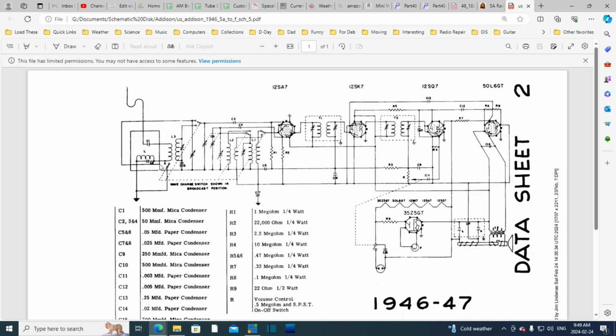So remember I showed you the antenna. There were 2 sections. One was obviously a large amount, looks like a racetrack of wire. And then inside was a circle, a small number of turns. And that would be this piece here. And this is the piece that's actually driving into the radio. This piece here, if you had a long wire antenna hooked up through a capacitor for safety purposes, through an antenna transformer, transform the energy onwards into the radio. You'd have this switch thrown here to switch between this large pickup coil and this much smaller and much more closely coupled arrangement. A little coil.